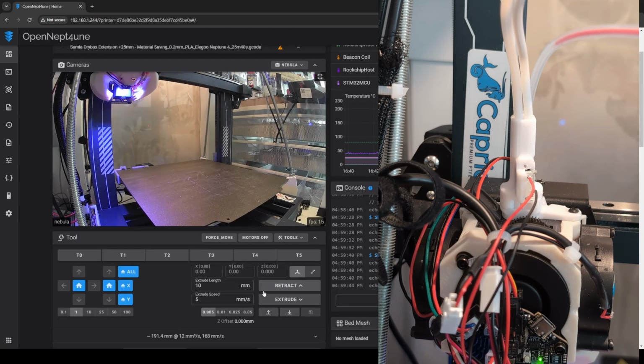Yes. This macro I made myself, but it basically just calls one of the existing macros 4 times in a row, just loading each lane one by one by one. And I like it because it very clearly tests the contact that your Pico's making with a filament. And you can see, okay, the Pico can load and unload all 3 filaments without any problems.